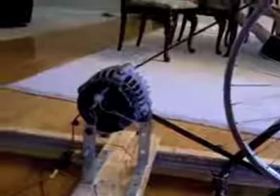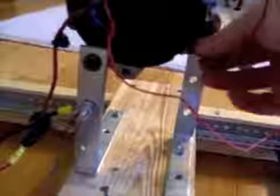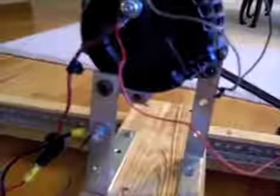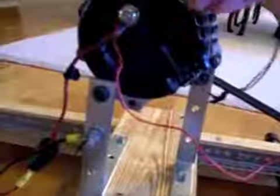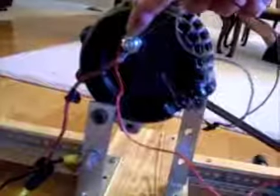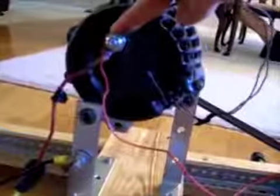When I was doing research on the internet trying to find out how exactly to hook up this alternator, there wasn't much of a circuitry diagram, and I'm not about to draw one for you, but let me just show you what we have done to make this work. There's a field sensing wire and a voltage regulator wire, and these have to see 12 volts in order to maintain the current. All we've done is take these and mount them right back to the post. This is where the current comes out. It's the same thing as attaching it to the battery.